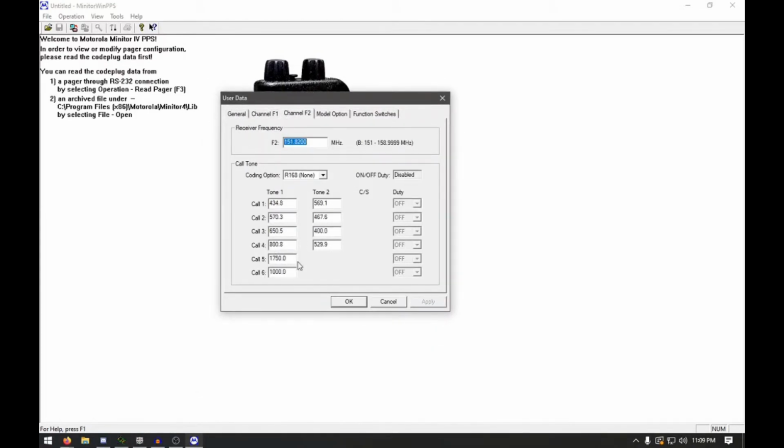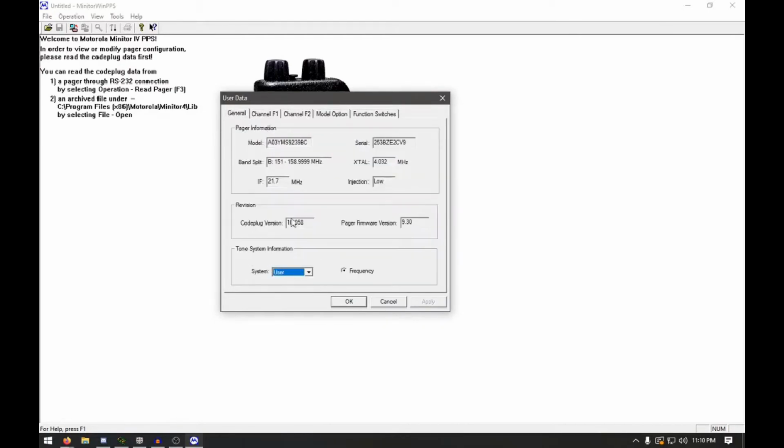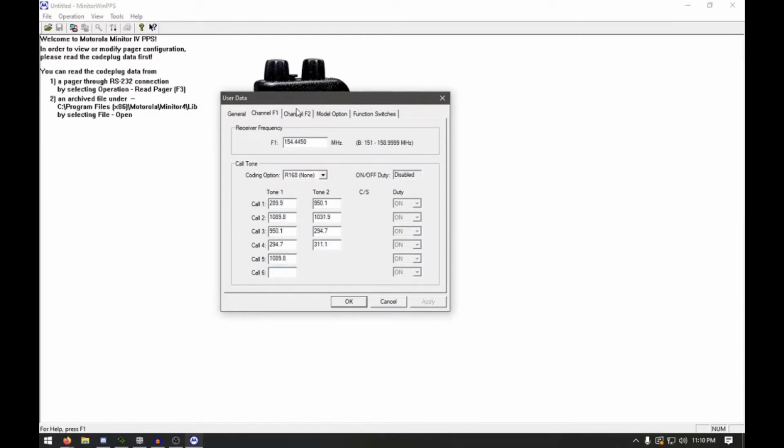At this point, your DIY pager is fully functional. When you press a button on the transmitter, it sends a wireless signal to the receiver, which lights up the LED to confirm the message was received. You can further enhance this project by making the pager portable, using a smaller Arduino Nano board, or even incorporating an LCD to display text messages or alerts.